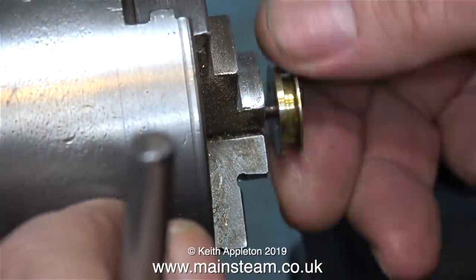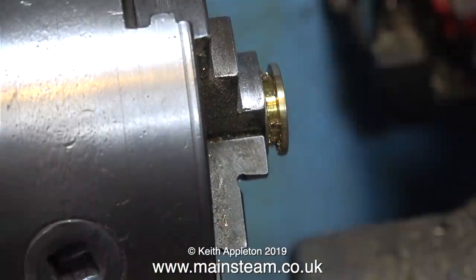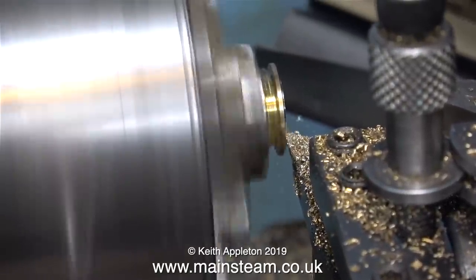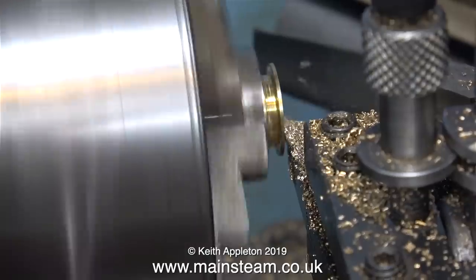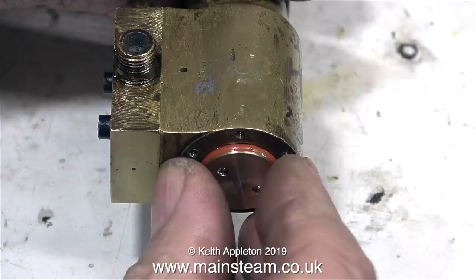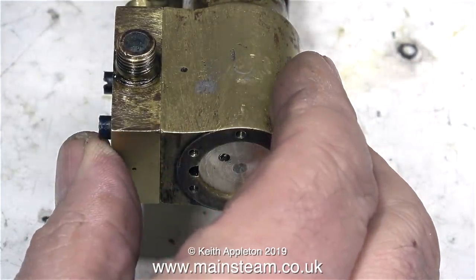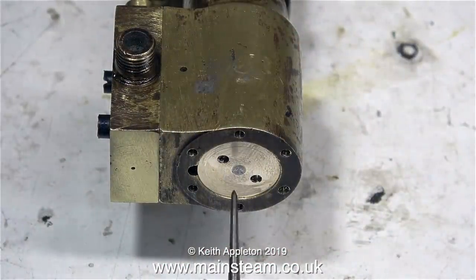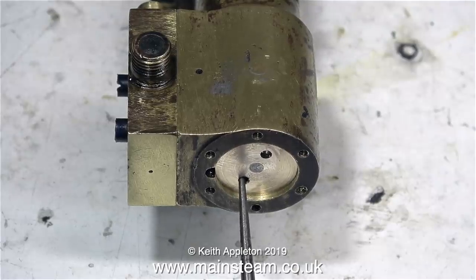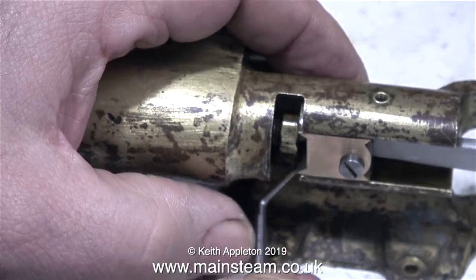I removed the sharp edges using a piece of sandpaper so I don't cut my fingers when I unscrew and screw the piston back on the other way. All I'm doing is thinning down the flange on the piston. The piston ring is a bit thick but it will be okay. I've refitted the piston ring to the piston, oiled the entire cylinder and the piston, and now I'm fitting it in place. I'm not going to tighten the piston at this stage because I need to make a new piston rod — this one's the wrong length anyway. The length of the piston rod was initially an estimate, but now I can take the measurements and make one the right size.